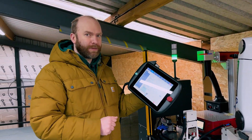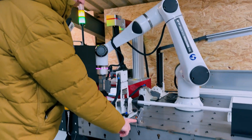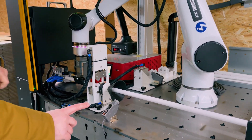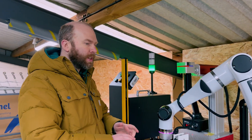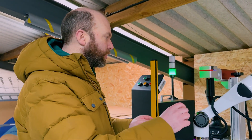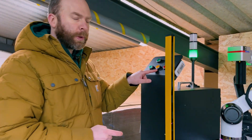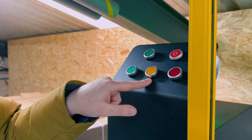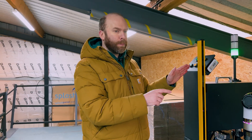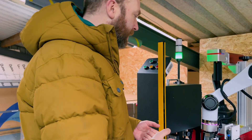It's almost like a toy and you're going to love it. I want to briefly talk about sensors and inputs for the buttons. This sensor here is a color sensor — it's detecting the white from the tube. It's an NPN style sensor. If you look up proximity switch, color sensor, any type of sensor, even safety sensors — NPN type 24 volt — two wires go into the control box. Same for the buttons: normally open buttons, I actually bought these off Amazon. Two wires straight into the input on the touchscreen controller. You just select that input as the start, stop, or pause button. Super easy and very user friendly.